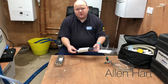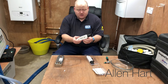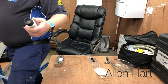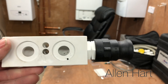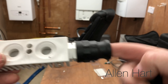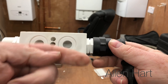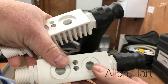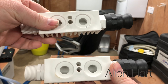You get two adapters. Only one side is working on this - you've got water going into it, water coming through here, and then the water will go through the plate heat exchanger and then it'll go back through that one and out the other side. Now I'll connect that onto the plate heat exchanger.